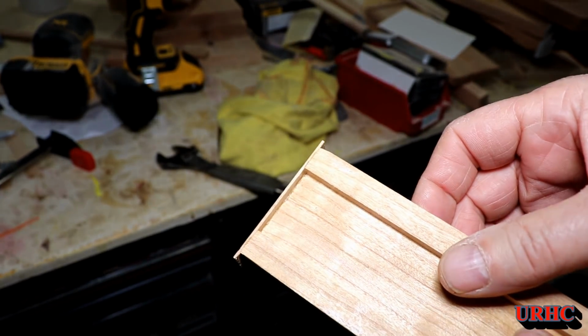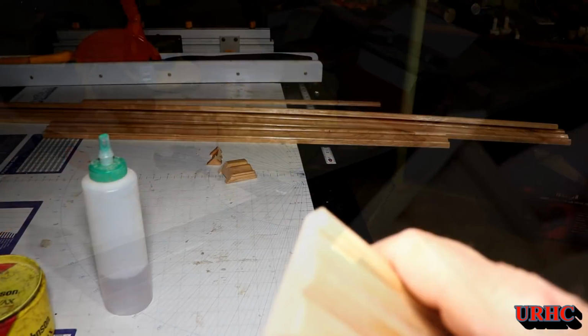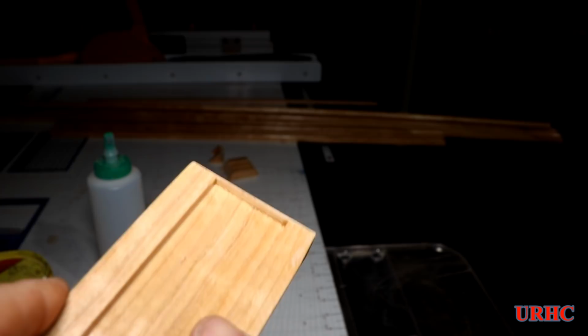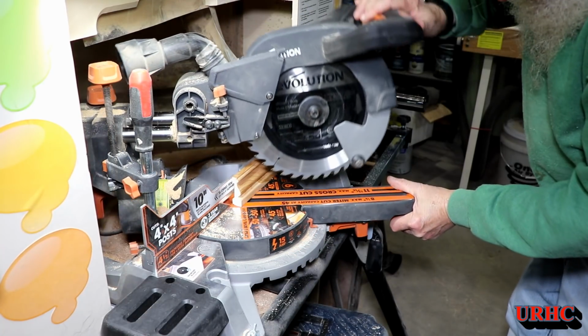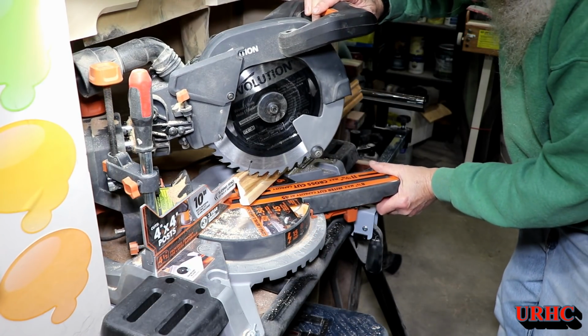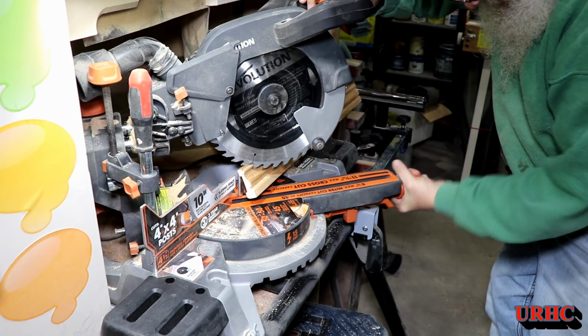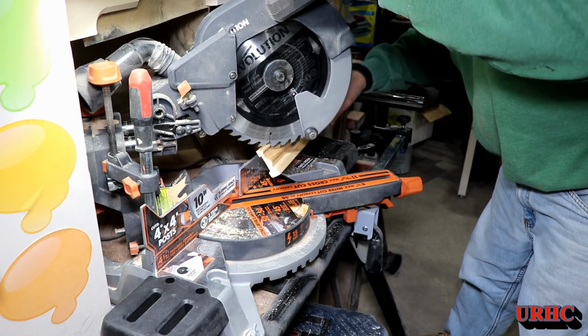And then a couple areas by the door, I actually had to go back so you didn't have end grain visible, and fill in glue pieces on the end, and then I just took a utility knife and carved them out, and then put a couple coats of polyurethane on it after it was done. And a couple more cuts, and I'll have all the moldings ready to install.